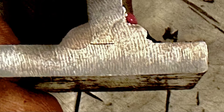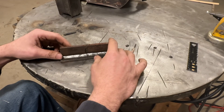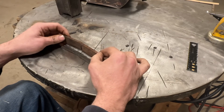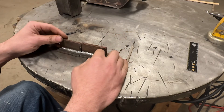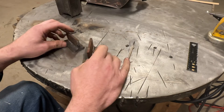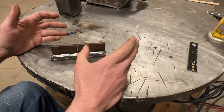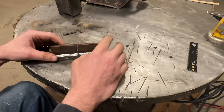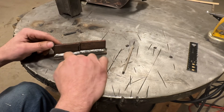Realistically, always prep your material, but if you don't, stick will weld through it. I'd rather have 6010 or 7018 unless it's a critical job, and if it's a critical job you're prepping your material. The results were a little different than I would have expected for both rods. I'm actually shocked at how well the 7018 ran over this. Had it been scabbier material it would have been worse, but welding over mill scale and rust - if you have to - 6010 would be the far better choice based on what we saw.